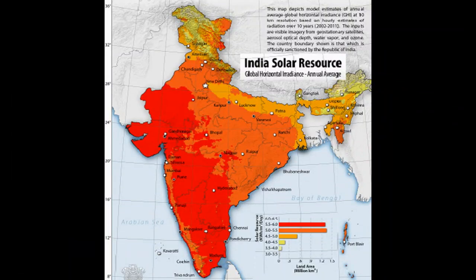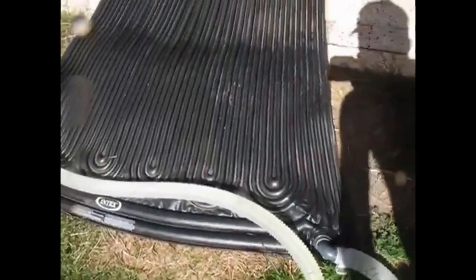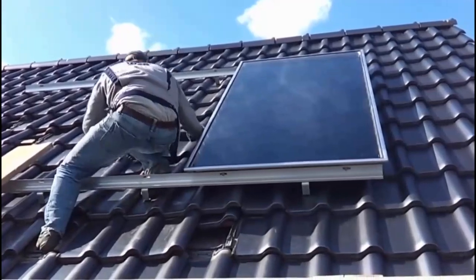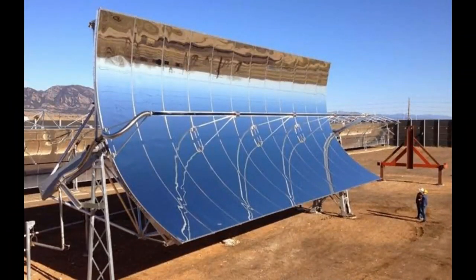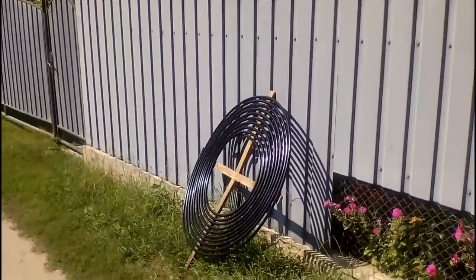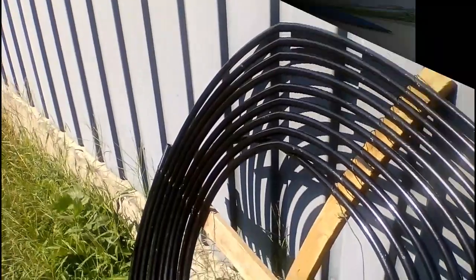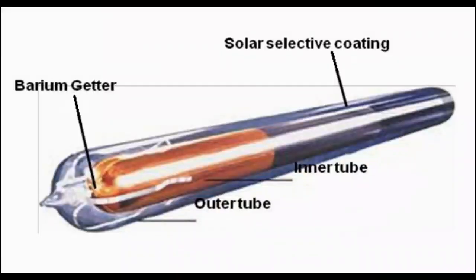So, if we want to predict the annual heat production of our solar collector, we multiply a certain proportion of the solar energy by the collector area. The area of an unglazed collector is its rectangle face. The area of glazed collectors is the rectangle inside their transparent cover. Concentrating collectors have an area almost equal to the area of their mirrors. The area of a pipe-type solar heater is the length of its black pipe multiplied by the outer diameter. The area of evacuated tube collectors is the total length of all tubes multiplied by the diameter of their selective coating.